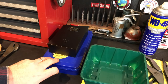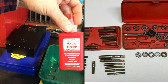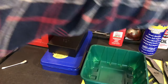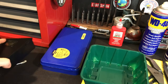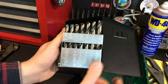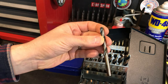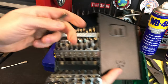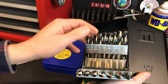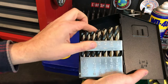Think about taps — how many times have you seen rusty taps? It's because the steel is really super hard. You're using some tap magic on it that gums it all up and gets grimy. It's always good to clean them with some WD-40, but this is the perfect item to use on taps. When you're done with it, it not only cleans it and protects it, it actually has a lubricant on it for the next time you use it. I just recently bought Viking drill bits — just under a hundred dollars. After I was done with the tap magic, I sprayed with the Maxi Film, got in there with a Q-tip, and let it dry. Now it's already protected for the next time, with a slick lubricant on it so it won't rust up. I plan on doing that with my taps and drill bits after each use.